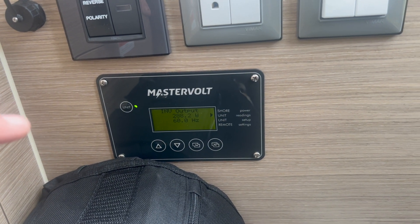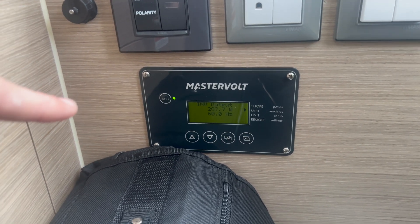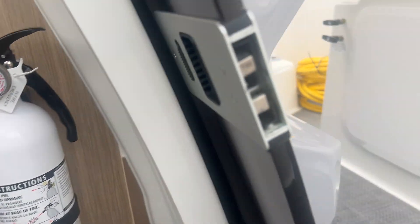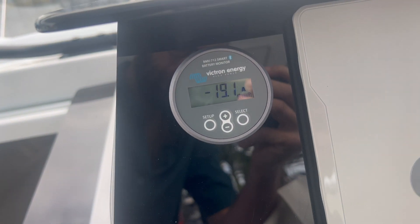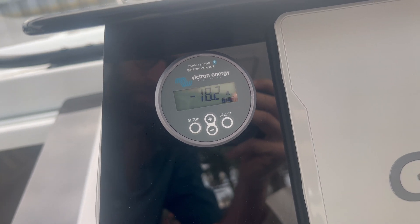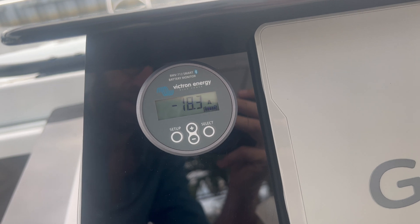We can see I'm already below 300 watts — 300 watts. Getting the true reading from the Victron display connected directly through the batteries, I'm currently pulling 18 amps — that's compressor running, fan running, and the pump running.